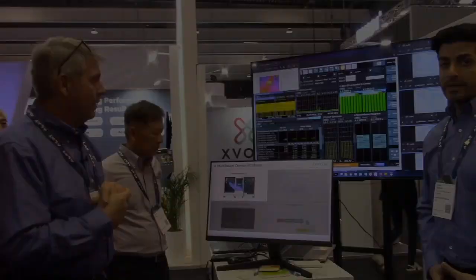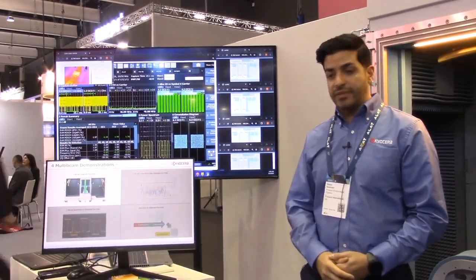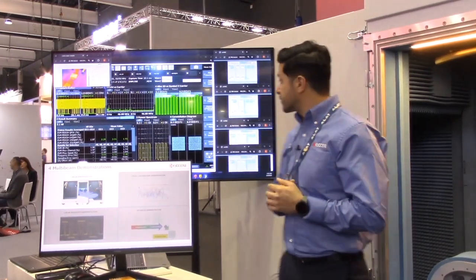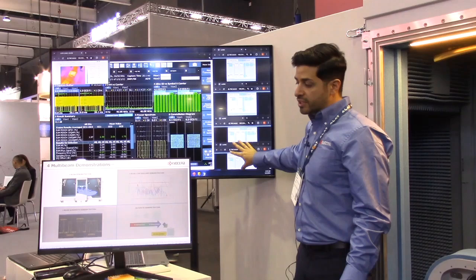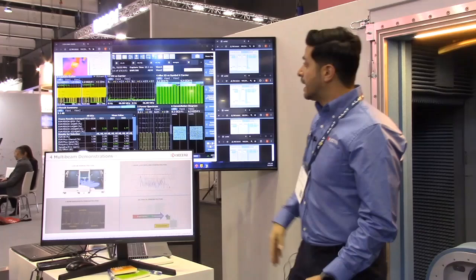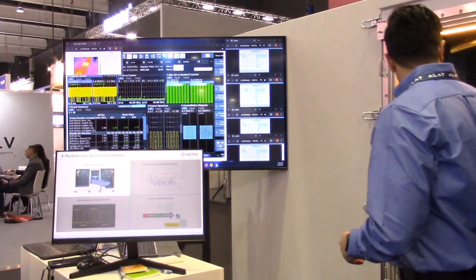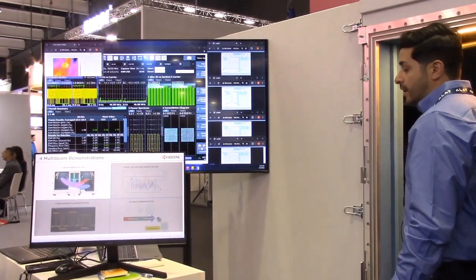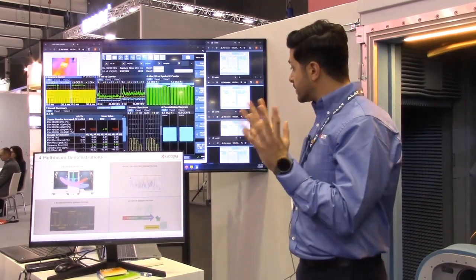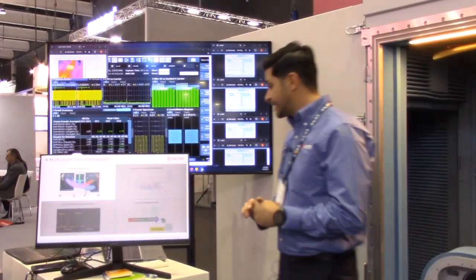We'll show you our first demonstration. Thank you, Andy, for the very strong presentation. So the first demo we have here features four simultaneous beams at four different frequencies pointing at four different reflectors. These are the frequencies of interest for this particular demo, happening from 29.1 to 29.5 GHz. That's a live demo — you can see through the thermal camera inside the chamber the heat that the antenna is generating, while simultaneously pointing at four different reflectors. This is in receive mode, to be on the safer side, because the antenna has a very strong radiation pattern.